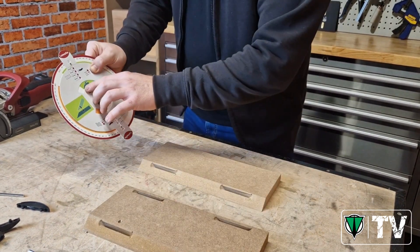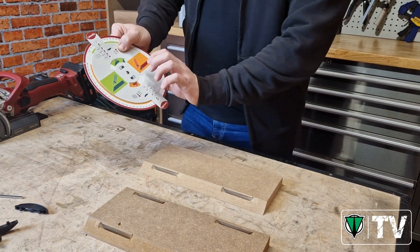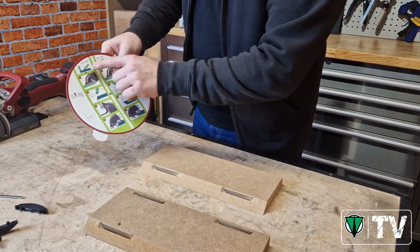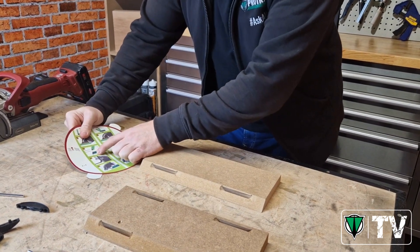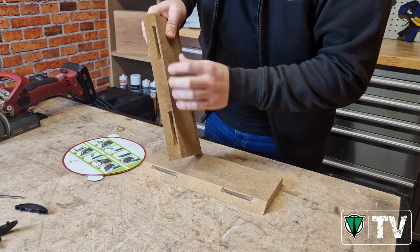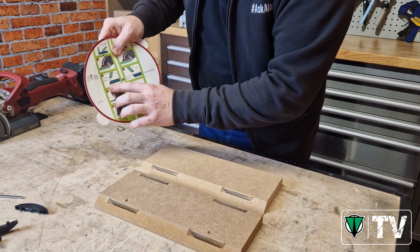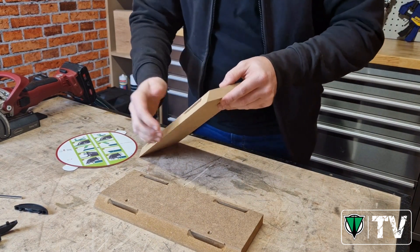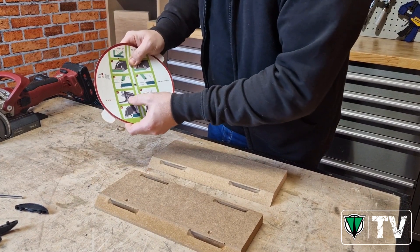We need to concentrate on the dark green part and creating the connector joint on this face. To get your measurements, it's all on the back. Because it's 45, we're working in this angle range, and we figure out our measurements here. On the green part, you measure from your outside edge to the middle of the connector — so from this edge to the middle of here. For this particular joint I've already measured it: it's 20mm. On the dark green part, you measure from the point to the top of the angle cut — from here down to here — and that distance is 19mm. So our total combined distance, A plus B, is 39mm.